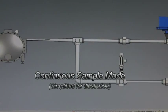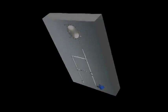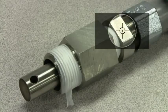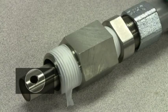Installation of the probe in continuous sample mode is very similar to the timed mode. Run a 12 inch piece of 1 inch pipe before the sensor and a 12 inch piece of 1.5 inch pipe after the sensor. When working with orifice unions, make sure the proper orifice plate is installed in the union. Install the sensor into the cross and then align the two flats so that they are perpendicular to the pipe. This will ensure the sample flows through the opening at the tip of the sensor.